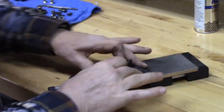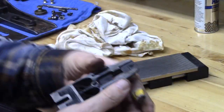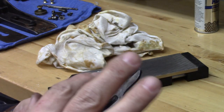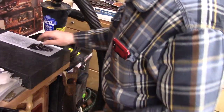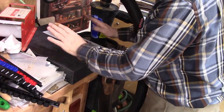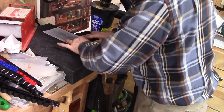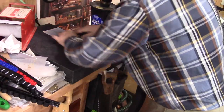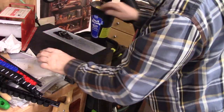and get this all perfectly in line. So it's coming. So let's see. You can see now these areas are coming. It's coming along. So we'll continue. It was taking me so long on that whetstone that I went to this reference plate of granite, extraordinarily flat, put some 120 grit, 3M or Norton, adhesive back sandpaper, and I just about got it where we want it.